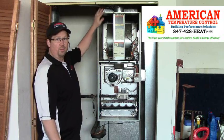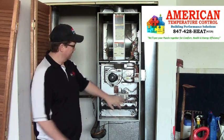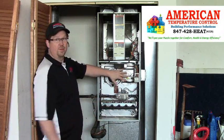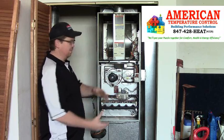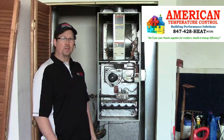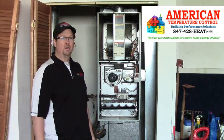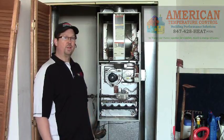To explain further, you have your blower motor compartment up here, combustion burn area here, and inside behind all these components and safety devices is your heat exchanger. So we're going to remove all these components and get into the heat exchanger and replace it. We know there's at least two cracks, if not more. So stay tuned and this should be fun today.